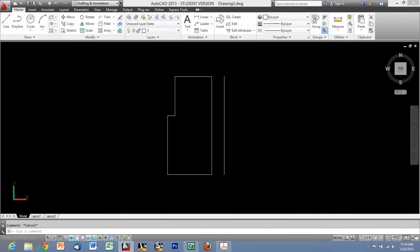So what I need to do now is figure out where the outside edge of that pulley goes over here, and then we can kind of put that web shape in the middle that connects the hub to the V-pulley on the outside. So what I'm going to do is offset that center line by 67 millimeters out to the left, and then I also need to locate that top to bottom. So the center of the V-pulley actually is based off of the center of this line. So if I take that out, that's really the center for the V shape that goes right here. And the next thing that I'm going to do is just take this line and offset it up and down by 17 units to figure out where the top and bottom of that pulley go.